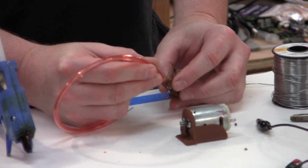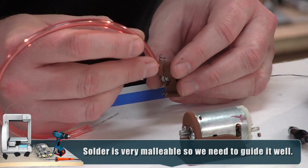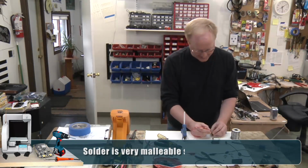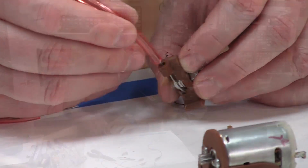So based off our task, we want to put this tube right up to the arm. We could just glue it in place, but if we want to do it right, I should make a countersink inside of the arm so the tube can actually fit inside of it a little bit, and then I'll glue it. Otherwise, it could just pry off. So I'm going to reprint this arm using that idea.